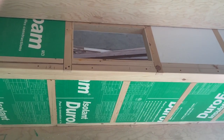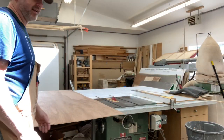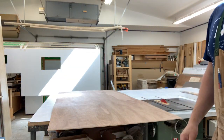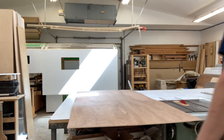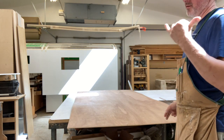First pieces to go on is that, so we're going to go to the table saw and cut that right now. So these things look pretty wavy. I'm just going to do a long rip. Normally I'd straight-edge this on the panel saw, but for my purposes the factory edge is probably straight enough. So I'm just going to rip my pieces and then cross-cut them on the panel saw.